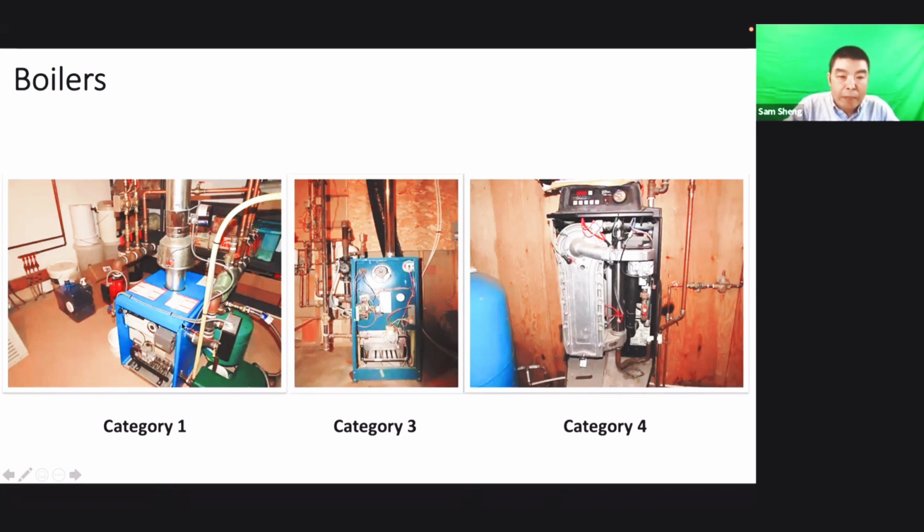For the boiler, we should have the water feed in. Normally for the water feed-in pipe, we should connect a backflow valve, just in case. For example, if the city water pipe outside the building is being repaired, it will suction the water from the boiler, and that's not allowed. I don't know about residential, but most commercial buildings need the backflow valve. In fact, it's normally called a backflow preventer.